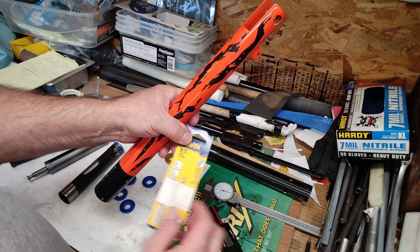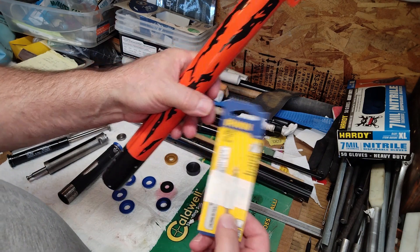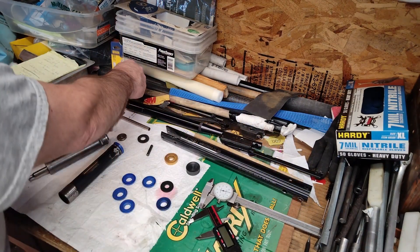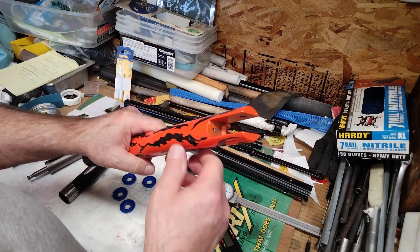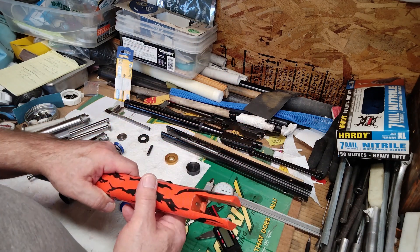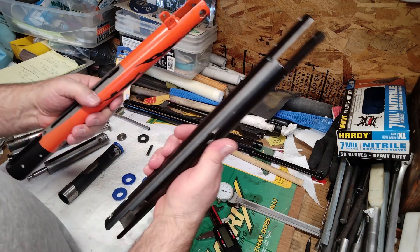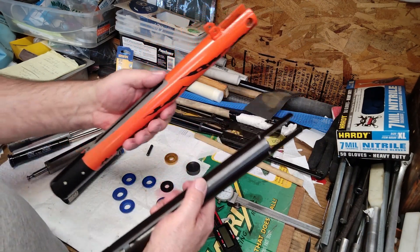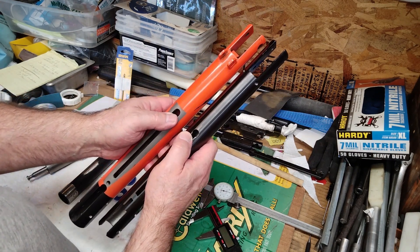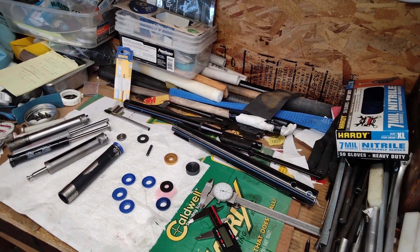I went and got some smaller bits from Ace Hardware. The one we wound up using is 2.95 millimeters — three millimeters would have been ideal, but you start with what you get, and drilling a hole often makes it slightly bigger than the bit anyway. Lining them up: this receiver is 29mm inside diameter, a typical R1 is 30mm, and visually we're pretty close — so we should be good with that porthole size.